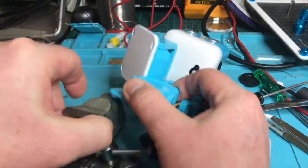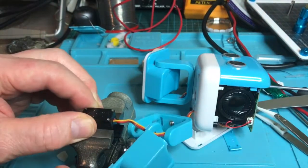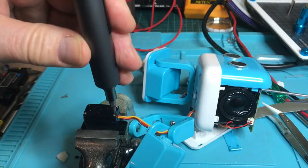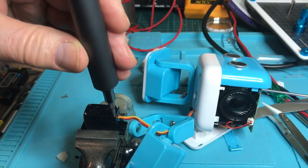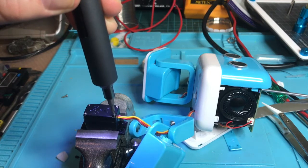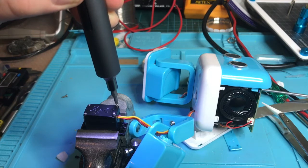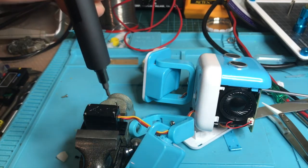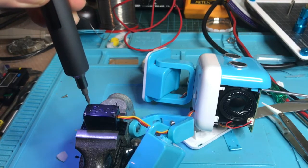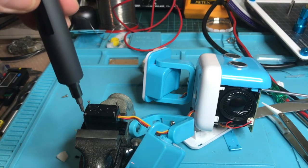Bring in the stand, bring the QB round. If you're using an electric screwdriver like this Wow Stick, you want to place the screwdriver on and manually unscrew the screw for a couple of turns and then use the electric screwdriver. Because if it spins and slips off it will strip the shape off the top of the screw and it will also ruin the head of the screwdriver.